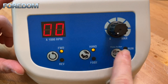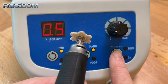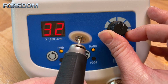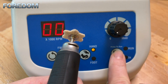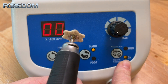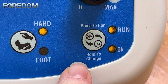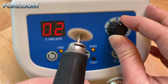When in hand mode you must press the run selector to activate the machine. I can dial in the desired speed — 500 rpm in this case — and press the run selector to make it run. While it is running I can increase the speed and it will do so quite smoothly. I can decrease the speed in the same manner by turning the dial to the left. The 1040 has two speed range choices: 5k and 50k. In the 5k mode the machine will run from 500 to 5,000 rpm, while in hand mode both the 5k and run lights will be on. You can smoothly increase or decrease the speed using the speed dial on the right.